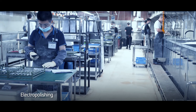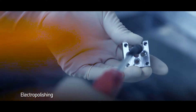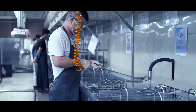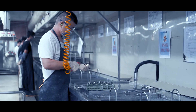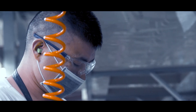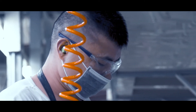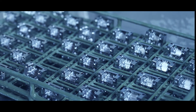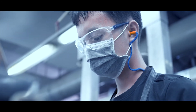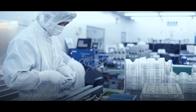Part of Compart's industry requirements of ultra-high purity components are achievable by Compart's proprietary electropolishing and passivation processes — an electrochemical finishing process that removes a thin layer of material and enriches the component surfaces with high levels of chromium, leaving a shiny and smooth anti-corrosive surface. Compart takes pride in its unmatched electropolishing expertise and state-of-the-art electropolishing lines.